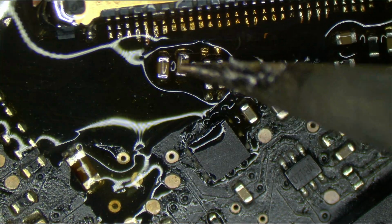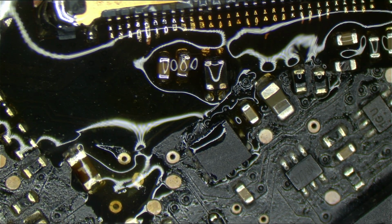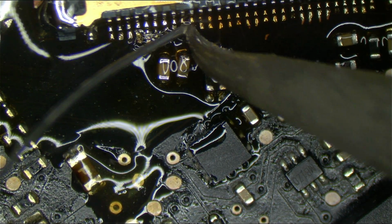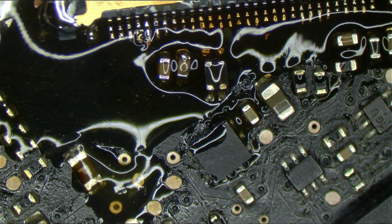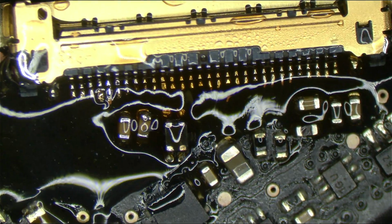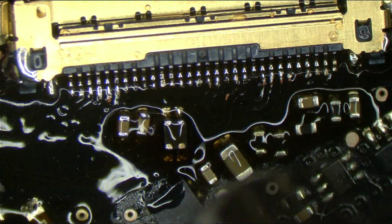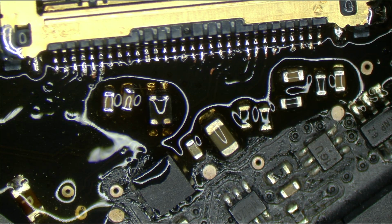I just made a mess. And I fixed it. Okay, there's one LED return pin over there that I did an awful job on. Okay, flowed. Flowed. Clean the flux off so that I can see it and do my joint test. This hot air is not at a temperature where it can melt solder, it's just at a temperature where it'll make the flux easier to move away with my ESD safe sparkle paper towel.